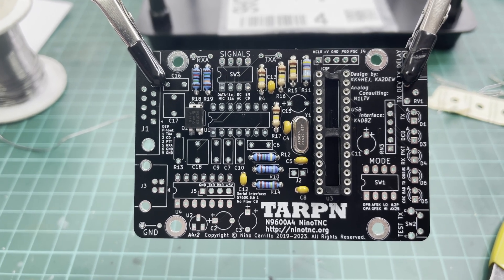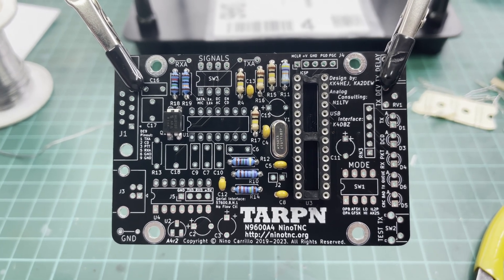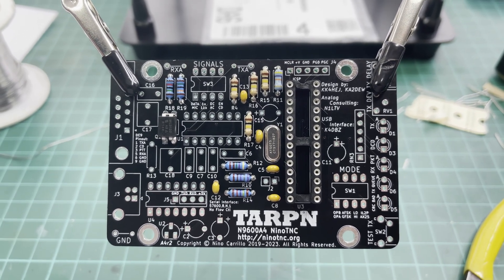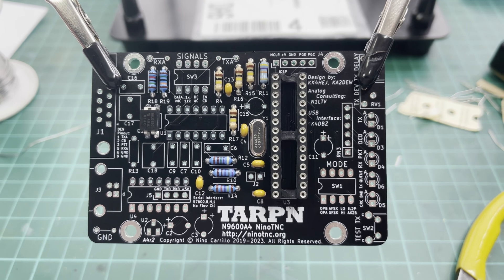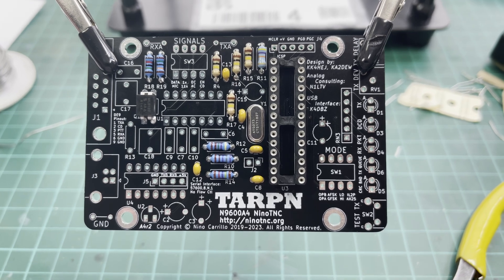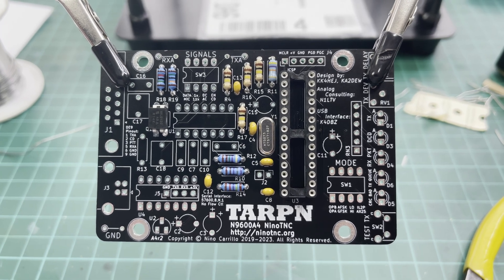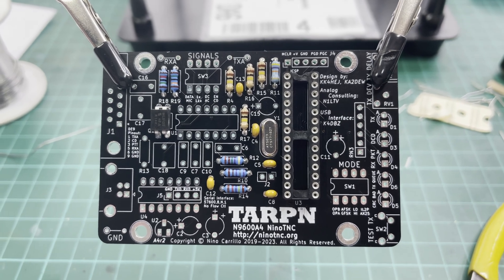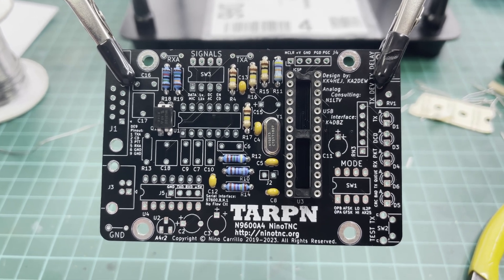So here's a start then. I've fitted the initial set of resistors and capacitors. There's still some more to put in but I'm following the build sequence in the manual. You can see the crystal there near the centre of the board and I've put in the socket for the CPU — a nice turned socket. No problems fitting anything. The resistors are tight; they just need a little bit of persuasion to lay flat, but that means when you turn the board upside down they don't fall out, which is excellent.